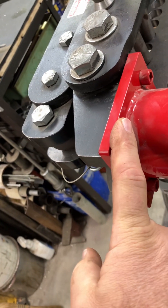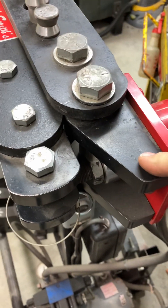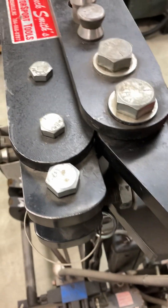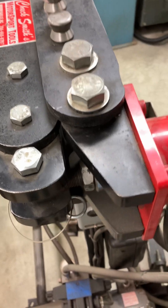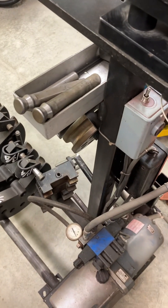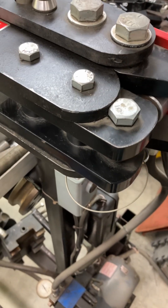And to adapt the cylinder, in my case this particular cylinder had a flange. So I just came up with these guys that I bolted in. I had plenty of stroke on the cylinder, so it wasn't like I had it cheated in. I just did this because it was the easiest way. And I also adapted this thick stuff here to put the actual rod end on.